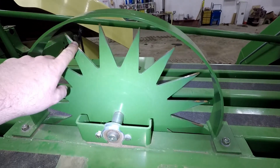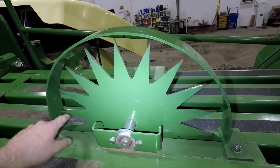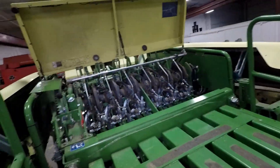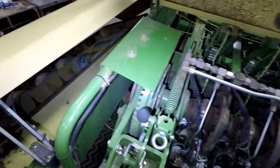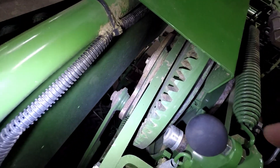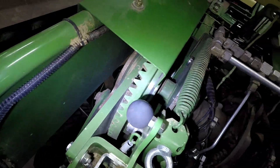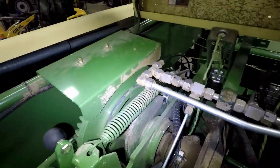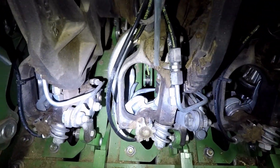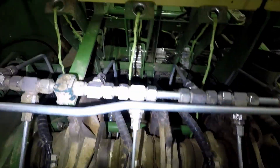This is actually our bale counter. It will basically have an electronic sensor measuring how many clicks that thing's going to make. So when your bale hits 8 feet, or however the predetermined length is, that will make the whole system tie. Up in here, we had our twine arms driving up here — our drive box coming up. This is going to be basically just a gear tooth for timing as well. So when it is time to actually go, that thing's going to trip, this little lever is going to move right here, and then each one of these knotter systems is going to actually make a knot all at the same time, and then make a second knot to start the next bale. So it's a double knotter system. We'll go through that as well.